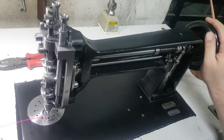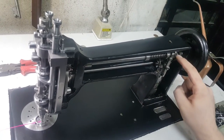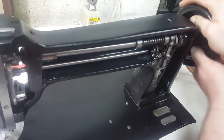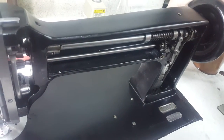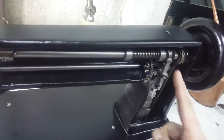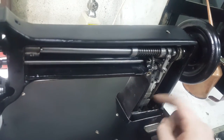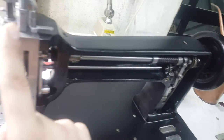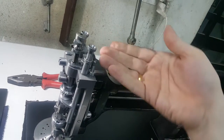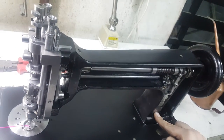Now, what we need to do is ensure that it is switched off. This rod comes up and the seesaw pushes this block here — which has got a gully — out. That will need to get done by hand the first time just to ensure it is working. That gap there is very important. If your machine is missing the parts, you will need to look over at this side here to ensure that this nut and the block it holds into is at the highest point. This system here will automatically ensure that that is correct.